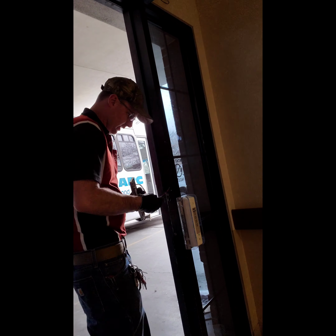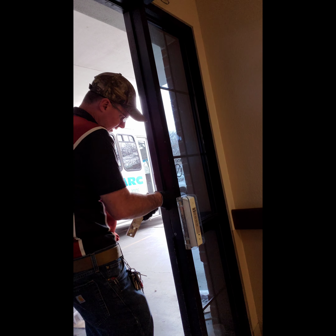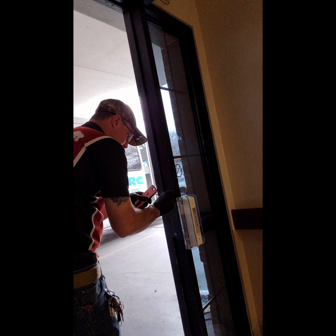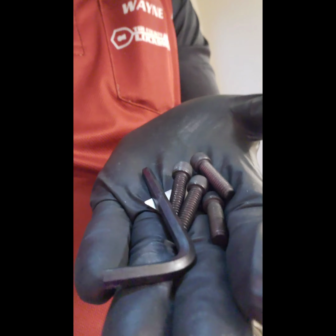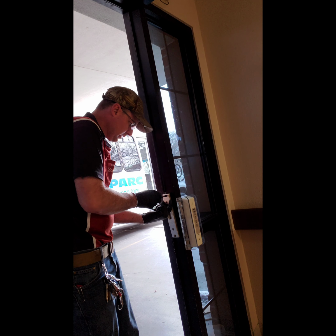Also, keep in mind that different nut zerts take different size external holes or different mounting holes. 3/8 is common, but some of the other ones require a smaller or bigger hole. Make sure you size that accordingly before you drill the hole. You saw me with the unibit 1 second ago. That is for the wires to go in.